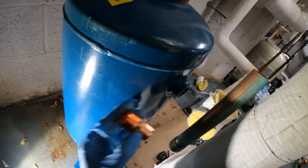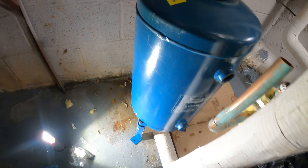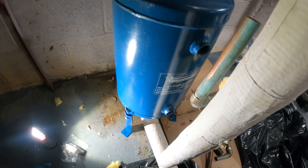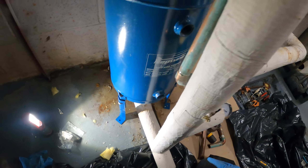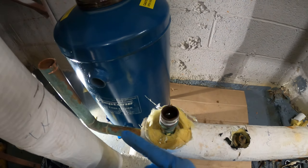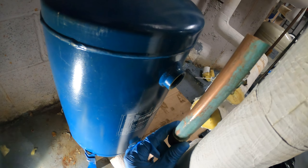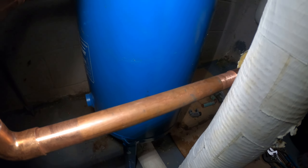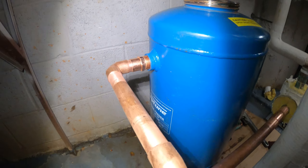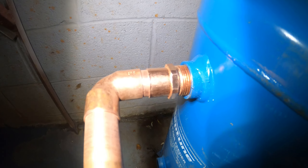The bottom connection is done, but now we have to go from here to here. Since this is threaded, it's going to be too close and kind of too much of a risk. I could probably make it happen but I don't want to melt the teflon tape, so I'm going to spin this tank a little bit more and just re-pipe this out going this way — let it come out and go all the way in — just to make things a little easier and safer. So I cut back on here; let's get everything into configuration.